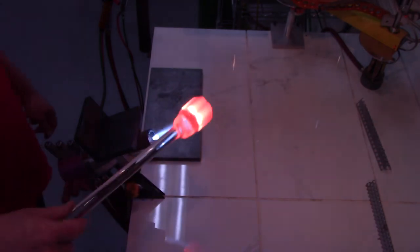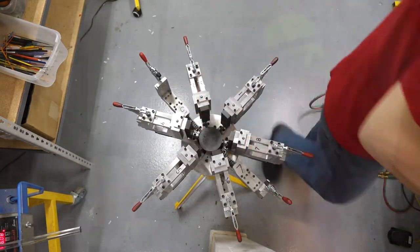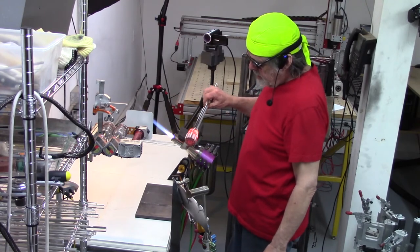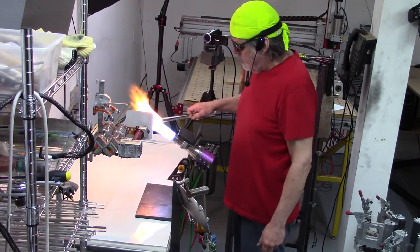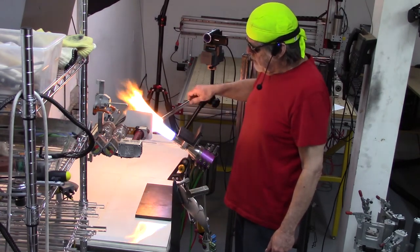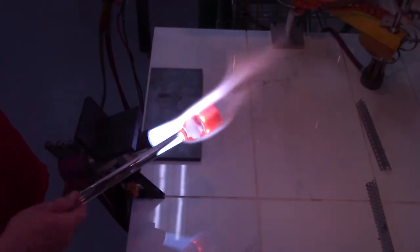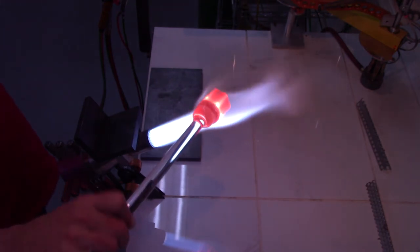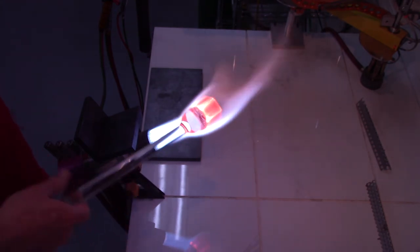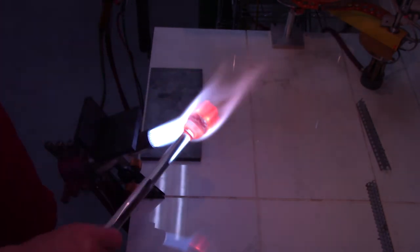So now, starting to build the heat base, oh, that pattern is starting to look really good. Got my corners looking good. My corners are looking pretty crisp. Every time I squeeze, the piece gets a little smaller in diameter and a little bit longer. I may end up being able to accomplish my goal of getting enough usable material just with squeezing,